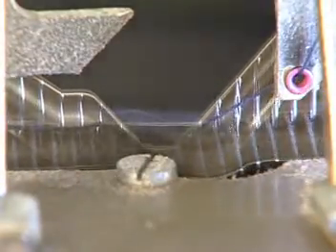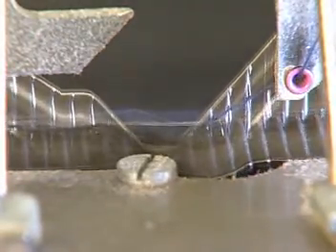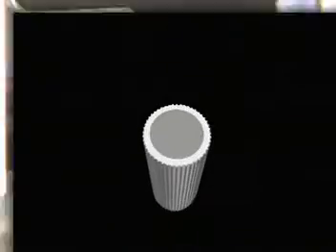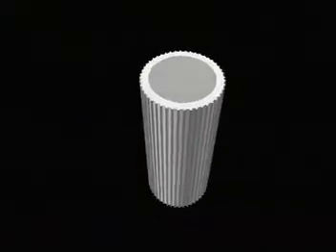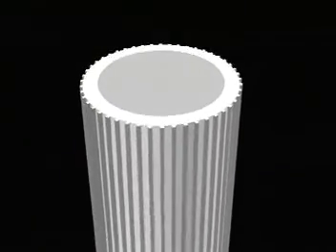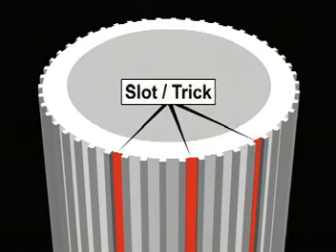In this segment, we describe how needles actually do their work — how they are arranged, and what causes them to move. Knitting machines are designed so that each needle can be placed in a groove cut into the outside of a metal cylinder. The cuts or grooves may also be referred to as slots, or tricks.